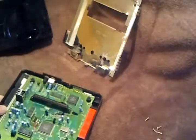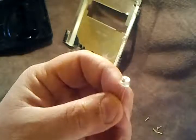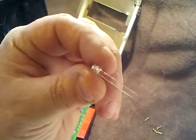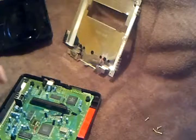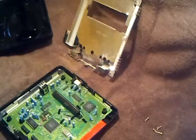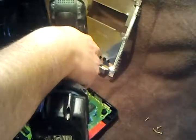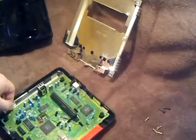I have a replacement LED here. Hopefully this should work. This is just a two-volt LED. Just remember guys, the shorter leg is the negative. There are still two more screws holding the board down here and here on the side of the cartridge slot. Let's take those out. Look at this hammer drill I'm using for electronics — figured that one out.